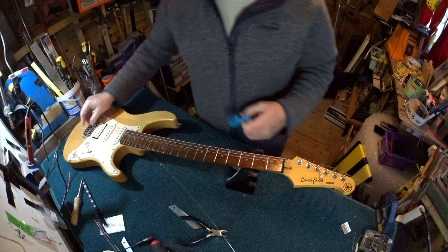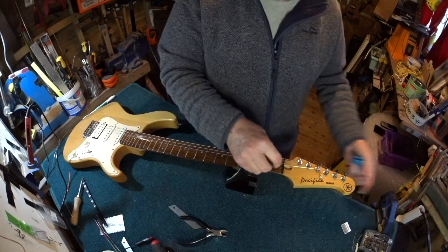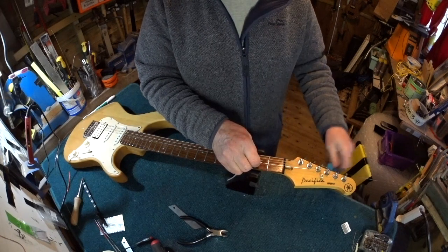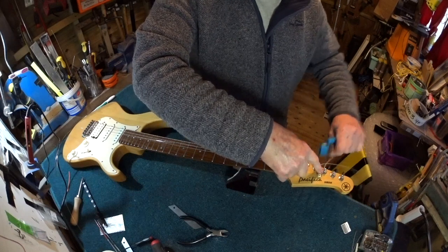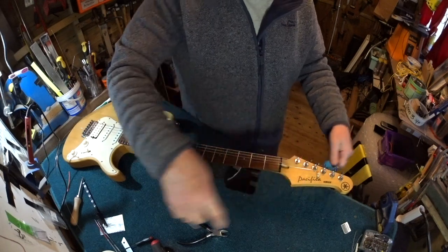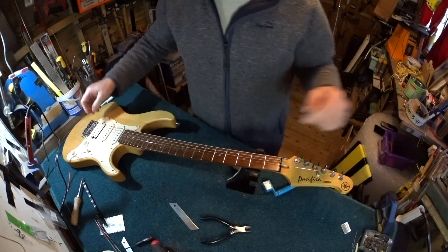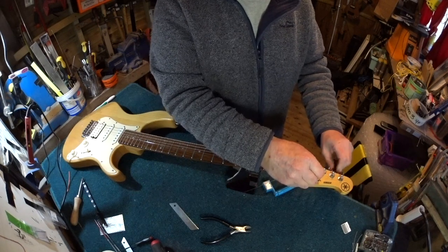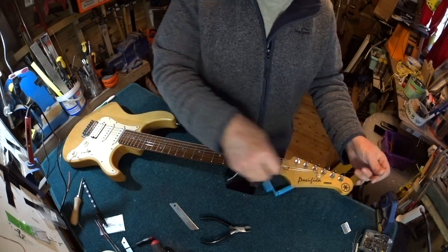What I do seem to know is wiring it the other way around seemed to make it work back to front, because the start point and end point of the sweep is opposite, which kind of makes sense, really. So if you find that that's all you have to do to make a pot work as a left-handed pot, then honestly I just think it's outrageous that that piece of information, as simple as that, is not available. And it would be hilarious, wouldn't it, if suppliers were buying in, inverted commas, left-handed pots, because they didn't know there was no difference. How funny would that be?